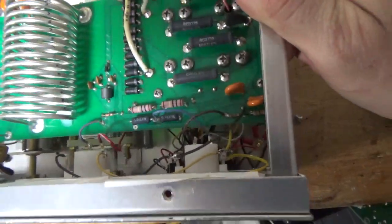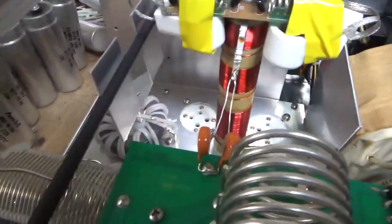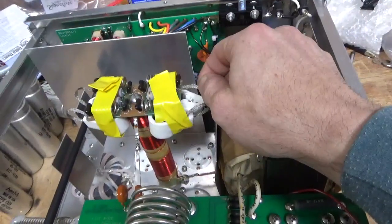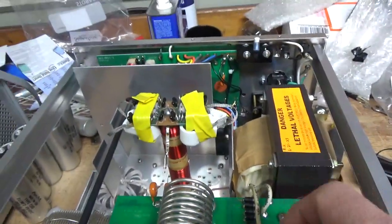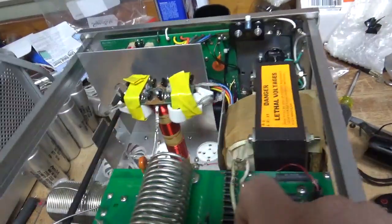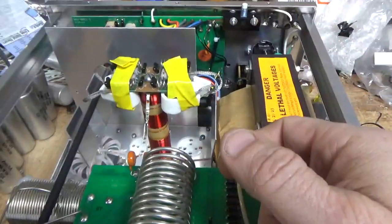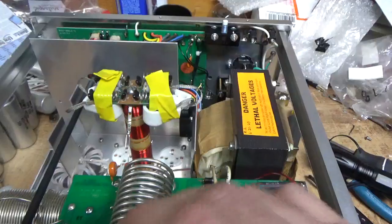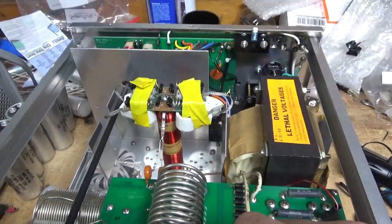He also added more LEDs — has LEDs within the meter movements and added more up top. I'm going to get to work. Please like, share, and subscribe. I'll replace the straps — these are really rigid. I'll also change the SO239s with ones from Max Gain Systems. These ones always fail. They use cruddy connectors at the factory — one's not great, the other is good, but not worth taking the chance. I go through it all while it's here.